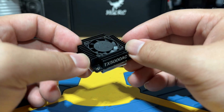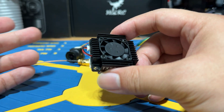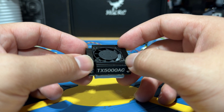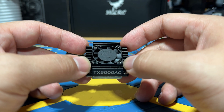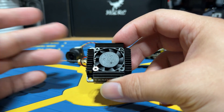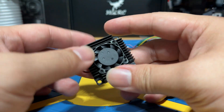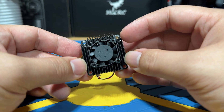One thing I don't like is AKK chose to use a custom VTX table format completely different from what your goggles or monitors use. When you see A1 in Betaflight but have to tune to L4 on your goggles, it adds a lot of confusion. I really wish future firmware would align with the standard table that everyone else uses, so it's easier to pick up without extra research.